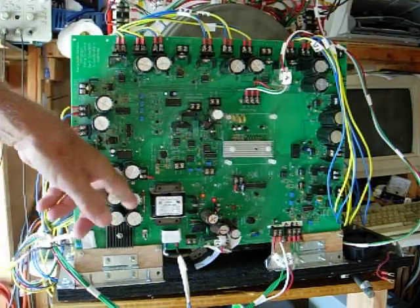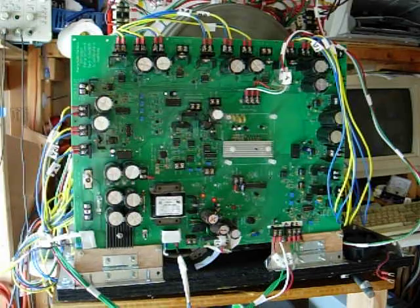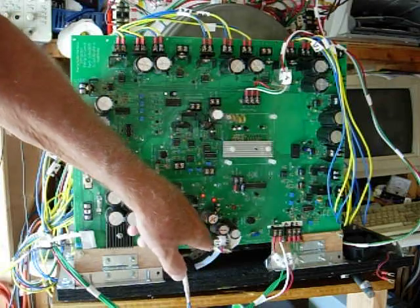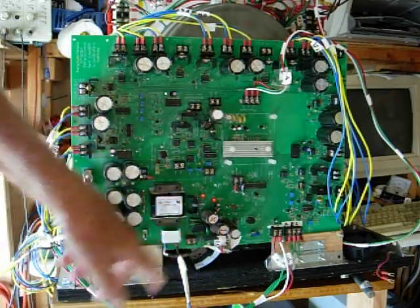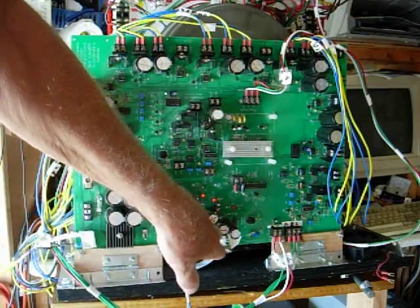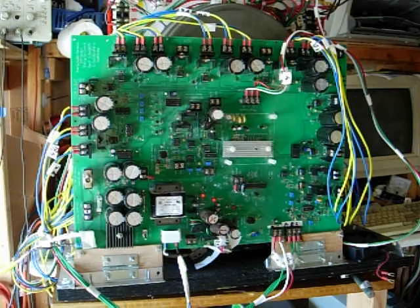But anyway, this is for remote high voltage, this connector. And this circuitry here uses a triac to manipulate and control AC. And that's another way of doing a variac if I wanted to. So I've bypassed that whole circuit for now to run the board. So next step, take measurements, do the adjustments, and we're off and running.